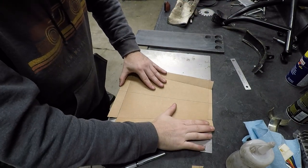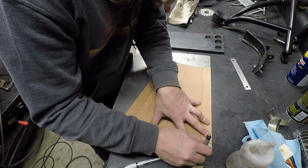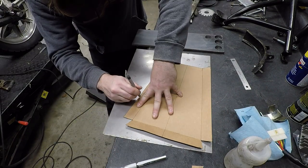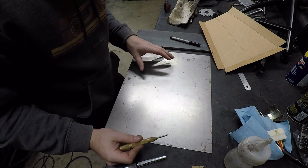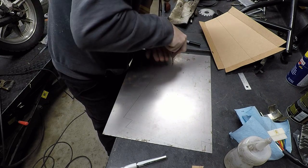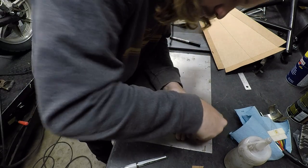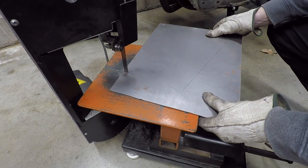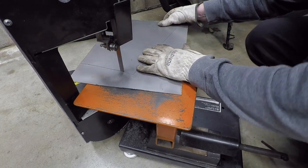Transferring it to metal now — I'm using 16-gauge steel. I feel like it has a good balance of being workable for bending as well as retaining a lot of strength. I know I can go lighter, but it gets a little flimsy. So 16-gauge is typically what I go with. I transfer it to metal using a marker, and before I cut it out, I mark my centers and my bends using a little center punch. That's because you'll inevitably wipe off some of the marker lines, and it gives you a quick re-reference point. Go ahead and center punch your bend lines, then proceed to cut the shape out.